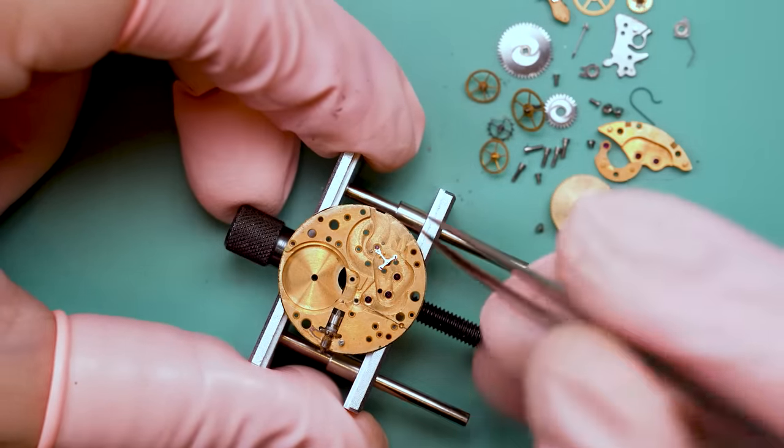I can get the last of the train wheels in, and then push the hack back into place — that's the hack mechanism I talked about before. Found a new mainspring for this watch, so we're going to install that rather than the old one — hopefully that'll help keep the performance up. When you get a new mainspring it comes in this little metal disc that holds it in place, and then you press it into the barrel. Whichever side of the disc has paint on it, that goes up — the bottom will be unpainted. There are different colors: blue, red, gray, and other colors. Now we can put the barrel arbor in, get the cap in place, and put the barrel into the watch.